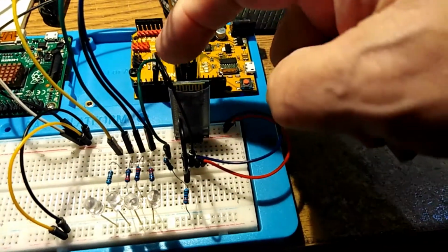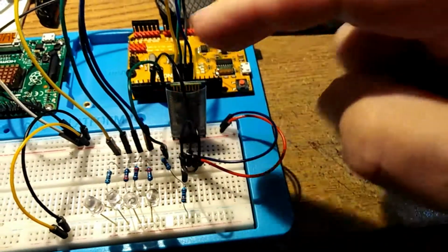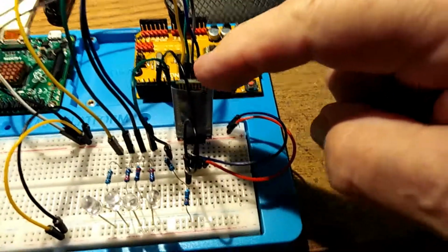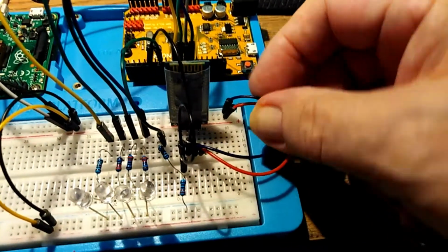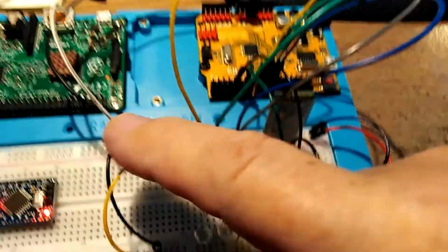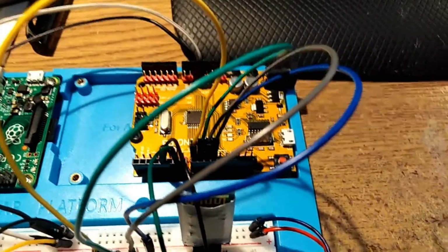This is the transmit pin from the Arduino. It is transmitting data to the Bluetooth module. So obviously that data has to go into the receive of this module. Other than that, we've got power and ground, which is 5 volts. As you can see from here, it's hidden behind these cables, but there we are, look. 5 volt and ground going down to the top bus, then linked over to the bottom bus. LED sitting on ground, and so on. That's it as far as the hardware goes.